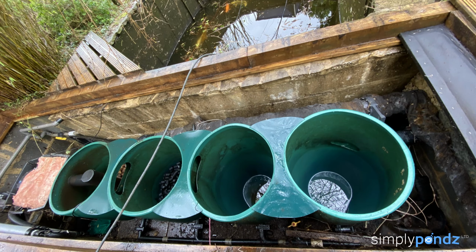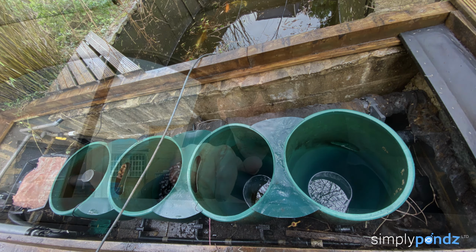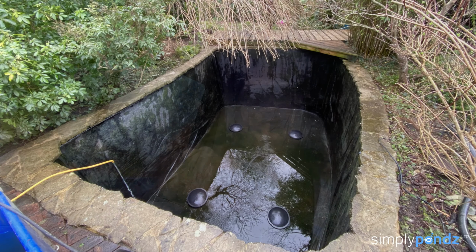So one of the jobs in particular, the customer had, you know, it was actually quite a nice pond. It was 7 foot deep. It was a nicely built pond. It had a big multi-chamber filter system. It had a pump which I think pumped about 16,000 litres an hour, but it had 4-inch bottom drains. So these bottom drains were sucking through about 3,000 or 4,000 litres an hour each approximately, and obviously all the dirt goes into the drain and then just settles, because the flow isn't strong enough to pull it into the filter where it's meant to go.